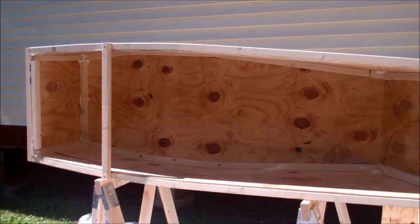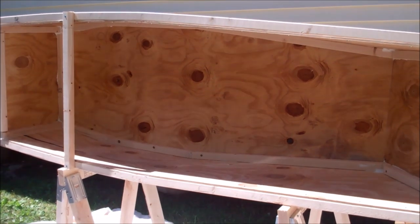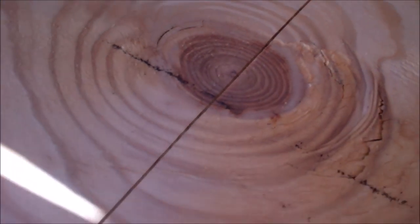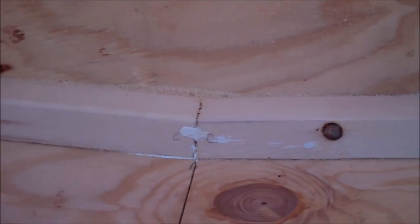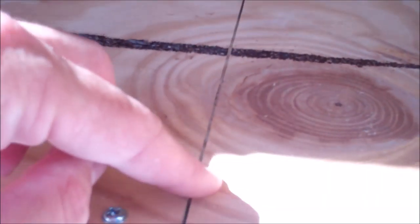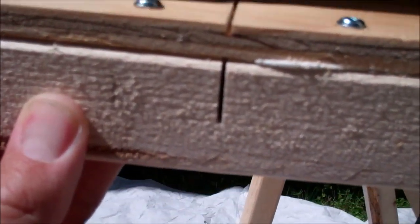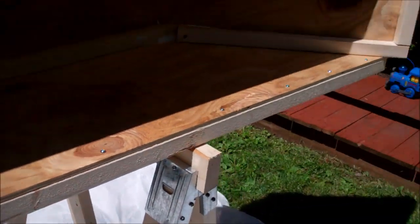And the way we accomplish that is with the sides are 18 inches wide, and all the plywood is 3/8 inch CDX construction grade plywood. And you can see here, I have a kerf set into the plywood, and it goes about a third of the way in. It goes one ply into a 3-ply board. And that was enough to get the plywood at the 2 points set. So I just took the base, and I chalked straight lines, and I cut triangles off the corners and used a curved piece of 3/8 inch plywood here. When making this outer banding out of 2x2, again I just put a kerf in the 2x2, clamped and screwed it as I went, and that was enough.